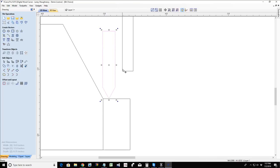So if you do set a flat depth and you're choosing to use a flat area clearance tool, your flat bit, you want to choose an appropriate diameter that will be able to get up close to those letters and get those flat areas.